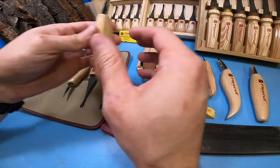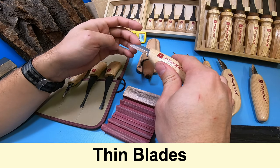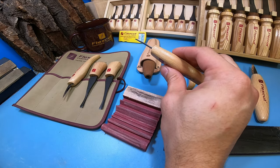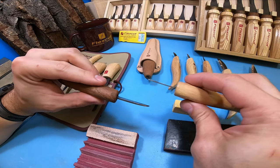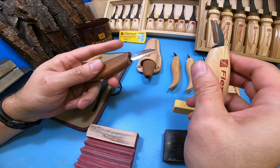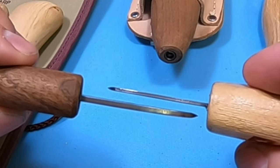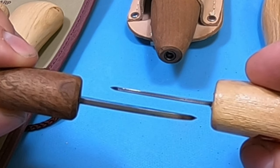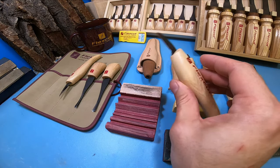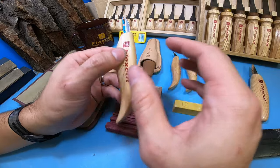Another cool thing I really like is the actual thinness of their blade. It's got a good thickness — not so thin that you risk breaking it too easily, but also not so thick that it's harder to push through the wood. For comparison, here's a Beaver Craft knife, which is the other decent option for beginners. These knives are notably cheaper than the Flex Cut knives, but you can see the Flex Cut blade is about half the width of the Beaver Craft knife. That thinness allows you to push the knife through wood very easily with less resistance than some of your cheaper options.